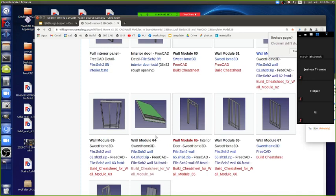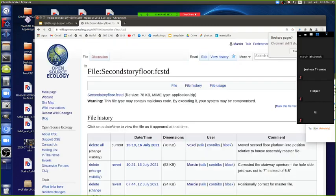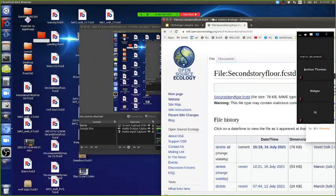We talked about how we pre-build the edge joists with the blocking to locate all your joists, so we're not guessing where it is. So when we get up there, one after another goes right up. We have to do the same for the roof, meaning pre-build, pre-screw the spacers like we did before, just to locate all the joists. So we can do a repeat of what we did there in a workshop. Okay, with the second story platform, second story floor, this one. Let's take a look at that.